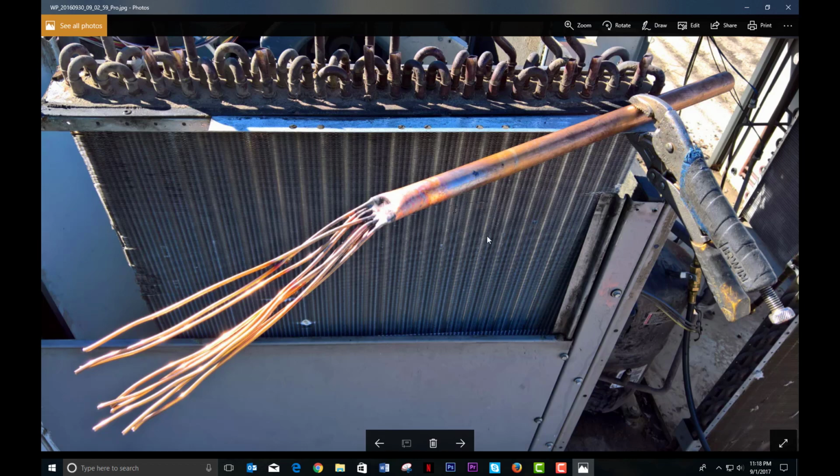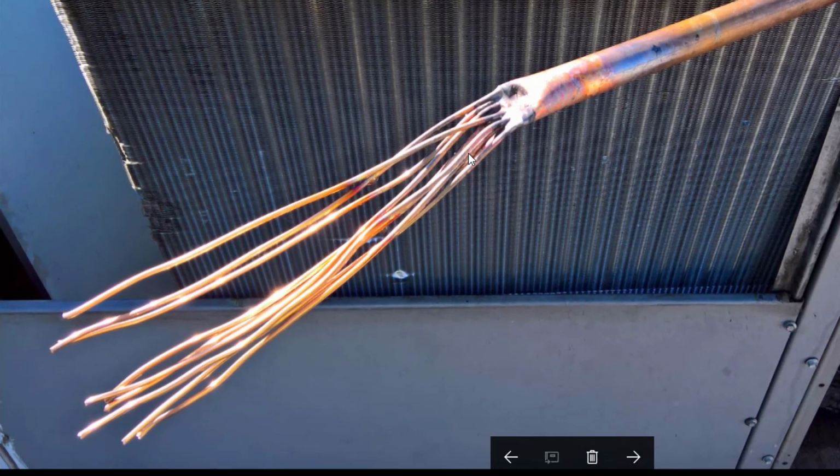So, here's the thing I do. This is capillary tubes. I just get the bigger diameter, and I cut them all even length. That's important. If you have small diameter feeders after a TXV, you need to make these even length, because these are also going to restrict refrigerant flow to some degree. So you need them even, or you're going to starve some circuits more than others. All the same length. You count how many circuits you've got, and you put those in there, and you just weld it. I flatten this, and I weld it shut.